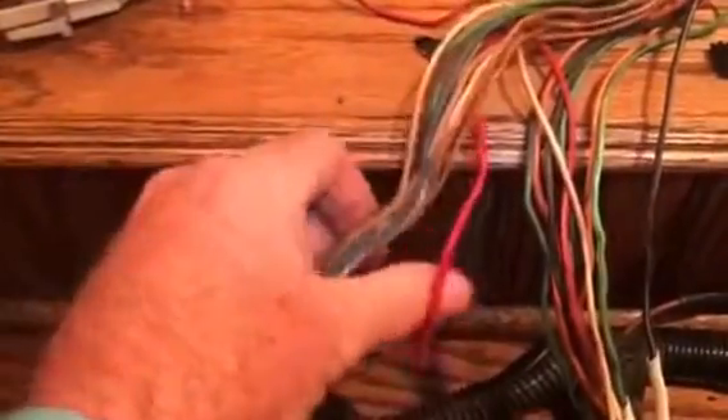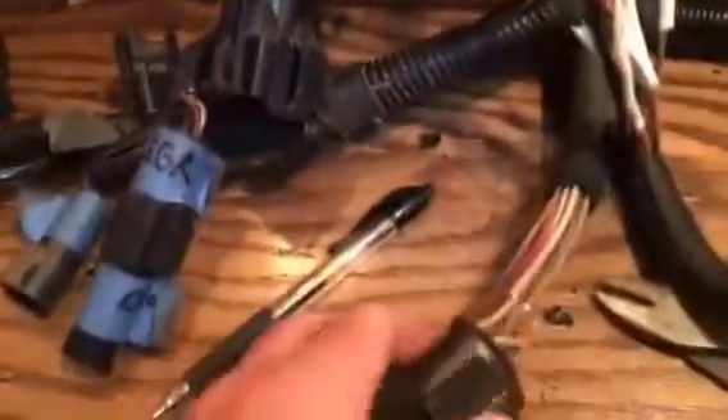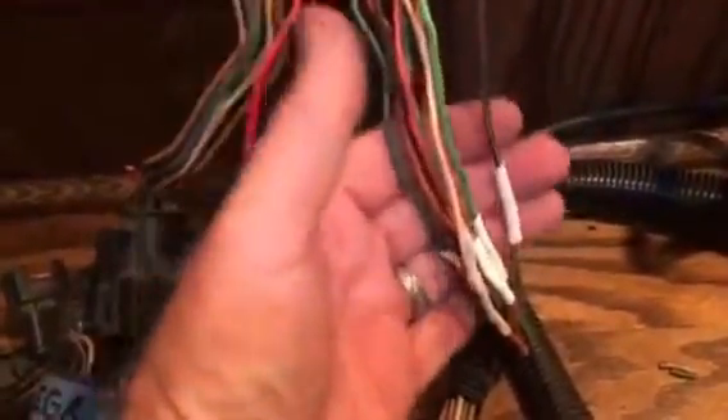If I pull back a little bit — here's the black one, this is on the engine side or the main harness side — and this is the power wire. I'm getting ready to roll that into the engine harness which is down here, so I'll be cutting this piece off and then splicing. I'll just have a big branch of wires here. This is where this tool comes in super handy.